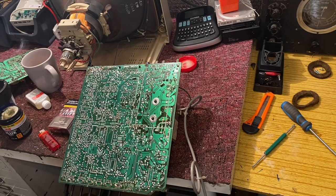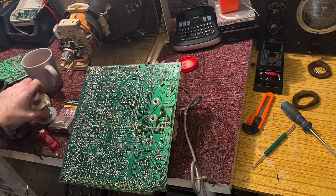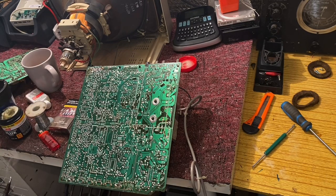I'll do the oven trick tonight, clean the board up, clear all the flux off it, and clean all the plugs and the sockets. Part two could be me continuing on with my tests, seeing if the board fault has cleared. If it was bad solder joints, great - if not, then I'm going to have to get the old oscilloscope out, which I really don't want to do. But never mind - cheerio everyone, thank you very much.